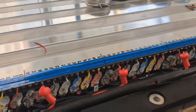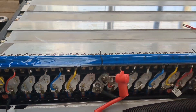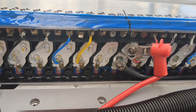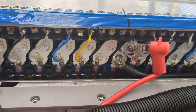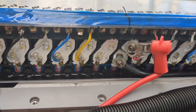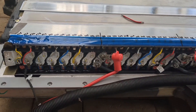All the BMS sense wires are now soldered on, going between the bus bars and the little cell pass-through terminals that go inside the cells there — all except for this little one right here, which I tore the nickel strip off when I was pulling the BMS boards off. I will have to spot-weld a new nickel strip onto there before I can solder anything onto it. Of all 126 cells, there was only one that I damaged, so that's not bad — it's less than 1%.